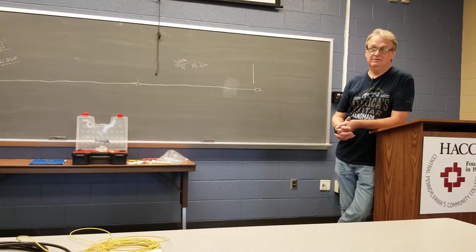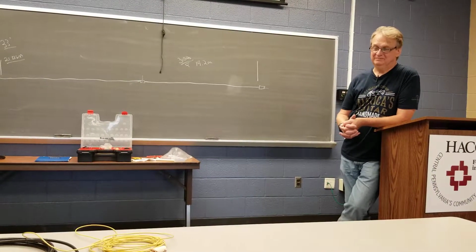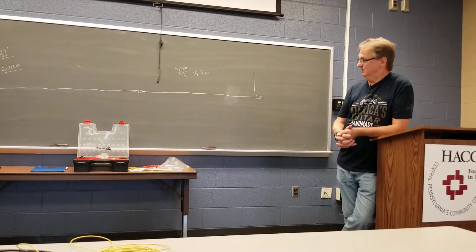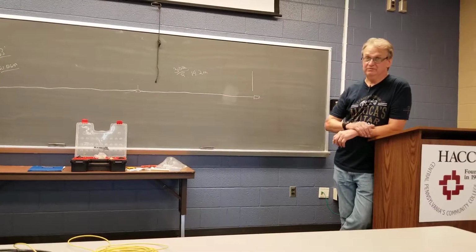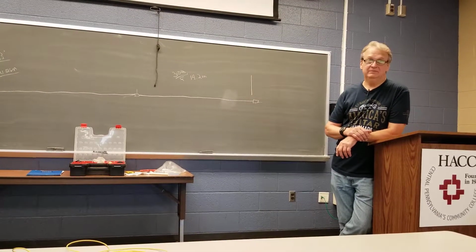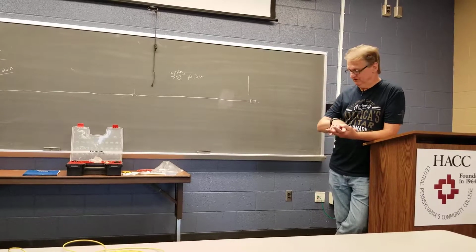Or you could just put it up as an inverted V and be at 50 ohm. You get a much better feed point impedance. Right. Inverted Vs do work much better for a number of reasons. Anything else? Anybody? That's all I got.